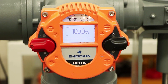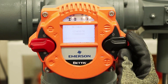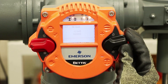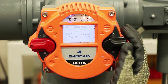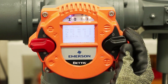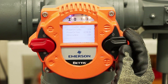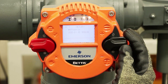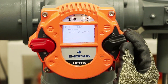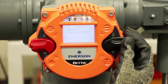If we want to look through the menus we put it in the off position. Going up gives us some outputs — binary outputs, binary inputs, analog values 4 to 20, absolute values of position and torque, firmware, serial numbers, counter values, hours on motor run time, and so forth. It also has a log of the history of events — 20 of the last activities that happened on this actuator. You can cycle through those and see the date and time stamp on them. Going down in the menu takes you through all of the configuration, starting with end limits.